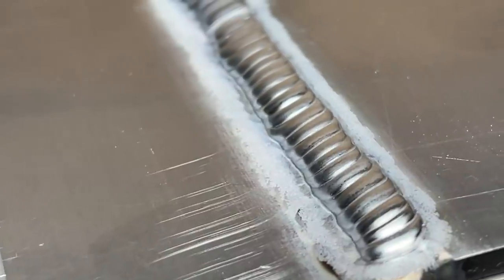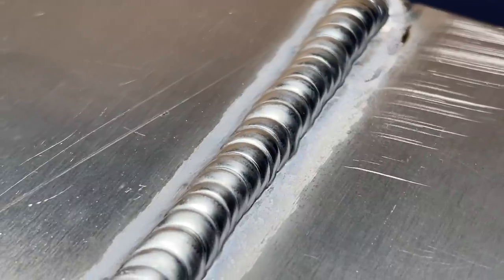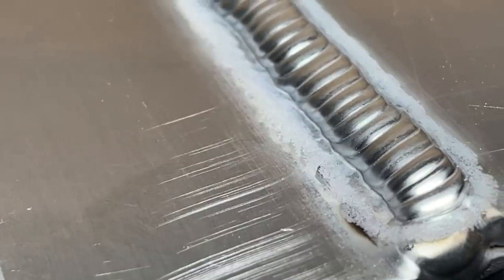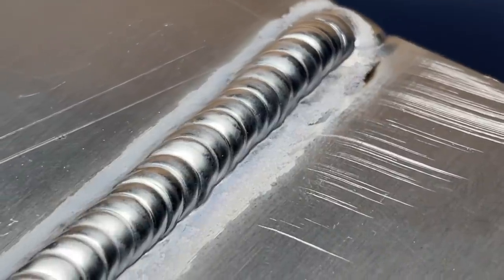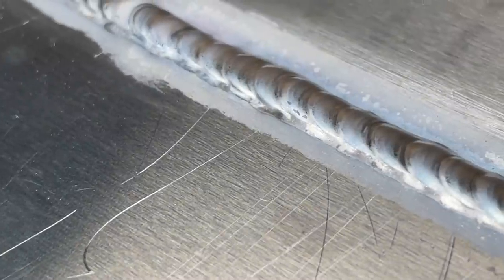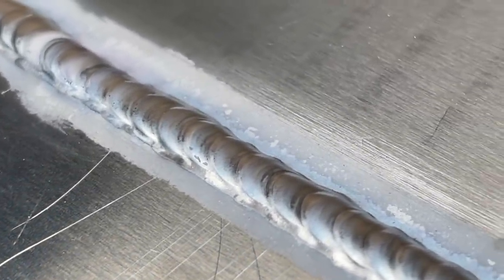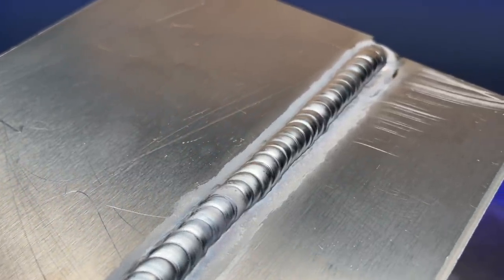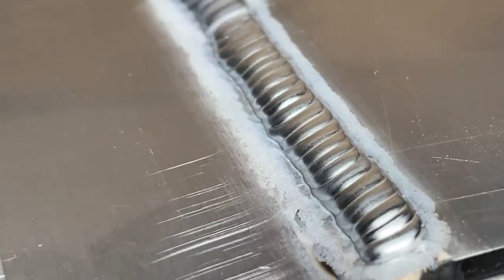The first thing that I see is one of the most common things that people struggle with on this joint. As we see here on the bottom edge, we have lack of fusion. Not only do we want to identify what the problem is when we see it, but we want to break down what caused it and how we can fix it next time. One of the most important things I teach — I talk about it all the time on my YouTube channel — is the start. See how it is relatively underdeveloped as far as fully blending into the base plate on the bottom edge, and we also have a little bit of erratic cleaning action. So the problem visible later down the weld is actually rooted at the beginning. We want to address this problem where it actually came from, and that is the start.